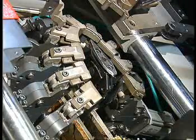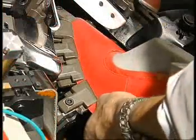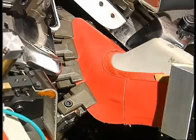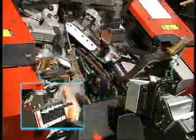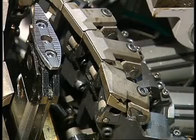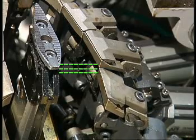The machine has 9 pincers which can also be operated manually using these levers. At the end of the cycle, the levers return to resting position. With Sincron Zero MW, the pincer pulling strengths can be preset when operated manually. The green lines on the graph show 3 different possible settings. Sincron Zero MW protects the upper from damage from incorrect operation.